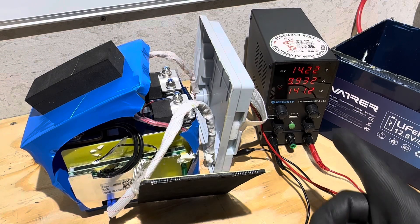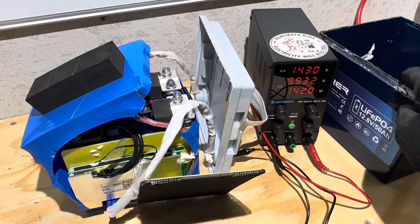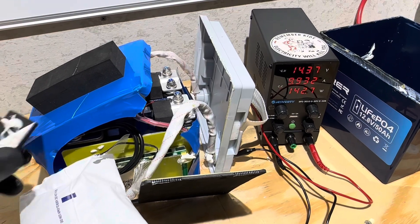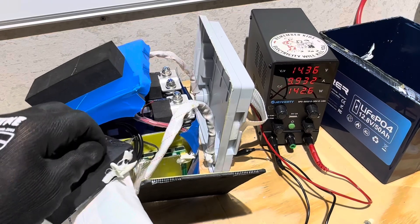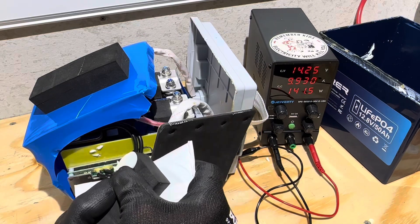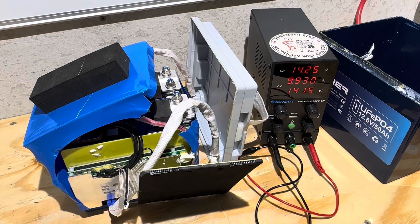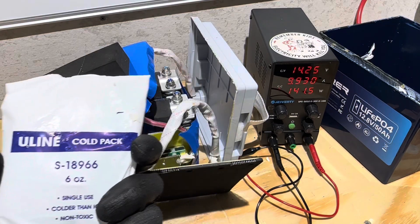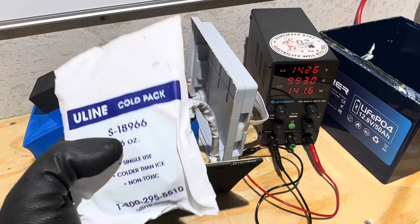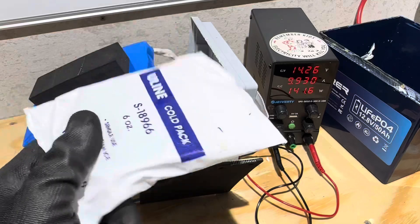So I've got the little Vader hooked up to the power supply right there. I'm going to test the low temp protection on it. I've got my ice pack just out of the freezer — same thing I always do, piece of foam on top of the ice pack. That's been five minutes and it ain't doing nothing. Usually the battery, when it's got the right program and right settings, that sensor will drop out with this ice pack within a minute flat. You've seen on other videos that the low temp cuts out real fast with this ice pack that comes out of a negative five degree freezer.